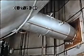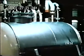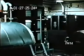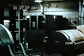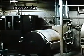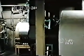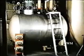Three miles per hour is normally used. In the basement we have all the equipment for sterilizing air. Here we have the liquid effluent sterilizer, the vent heater for sterilizing air removed from the sphere, the hot well which collects any liquid from the sphere, and the air burner which is used for sterilizing air removed from the laboratory.